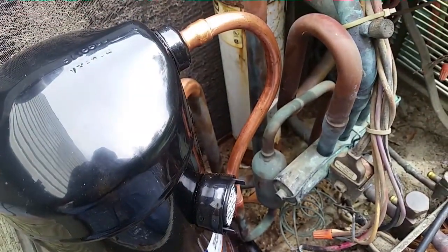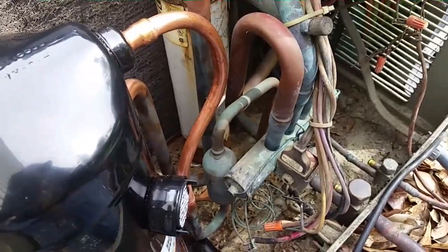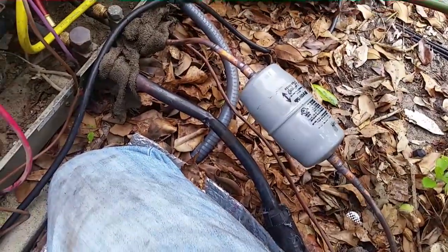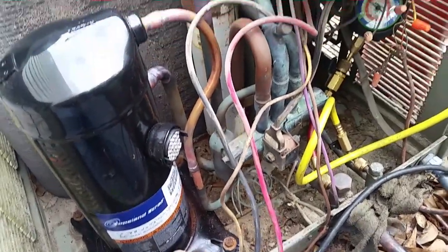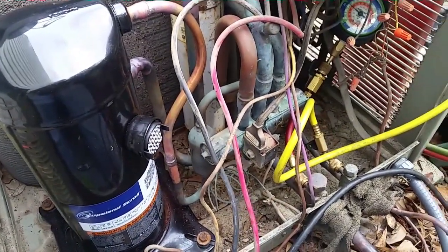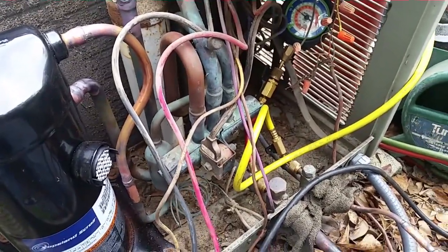After our pressure check we should be moving on to cleaning the coils, just making sure these repairs worked. I've got about 60 pounds of pressure on the system — everything left in my bottle after flowing nitrogen. I can't hear any leaks. I'm going to move on to cutting out that evaporator coil and bringing it out to clean it, then solder everything back together and test the system at a higher pressure while I clean it up.